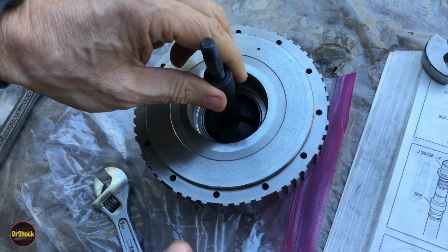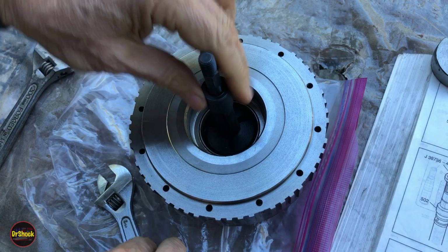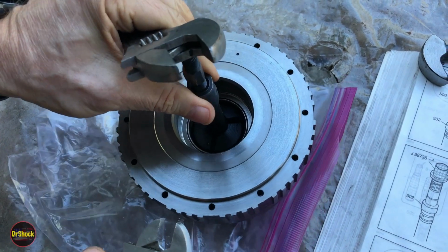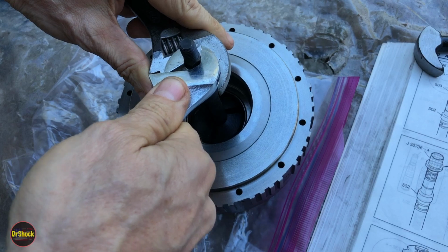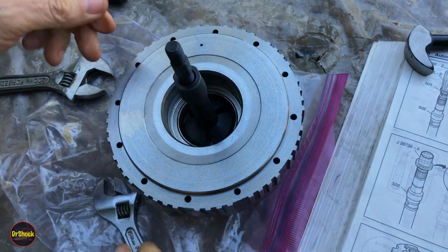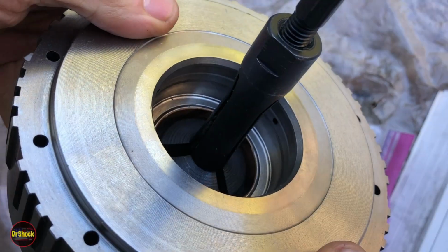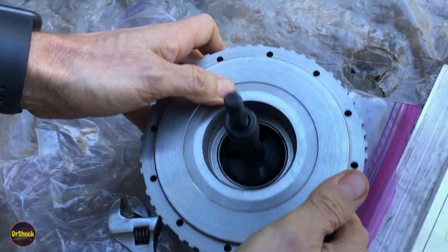All right, guys, basically you get to the point where you can pick this up. I like to get it where it's still turning just a little bit, and then give it a small additional tightening just until it becomes hard to turn, but you don't want it so tight that it's not turning at all, because then it'll be too tight against the inside bore. So that's probably a good place to start. This is another one where you want to take note of whether it is pushed in flush or inset. And this is another one that's pushed in flush.